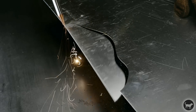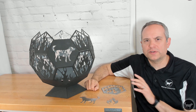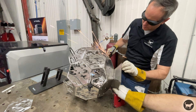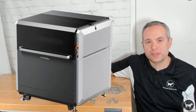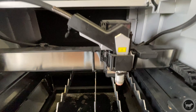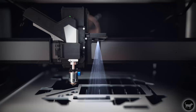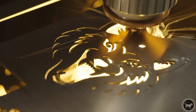This device can also be used for freehand cutting and cleaning of metal, although that was not what I used it for. While you could purchase the welding and cutting components, there's a second part of this machine: the CNC cutter that works in conjunction with the welder. The CNC cutter essentially attaches the wand of the laser welder to turn the tool into something controlled by X-Tool Creative Space software for precision cutting, much like the X-Tool S1 and P2 machines. It is equipped with cameras and smart functions for seeing what you're working on and optimizing the space.